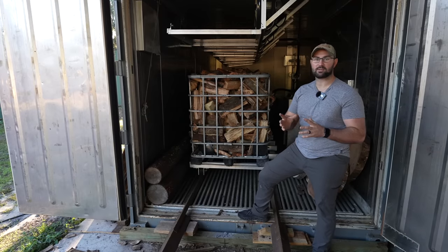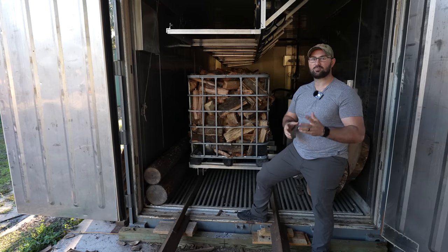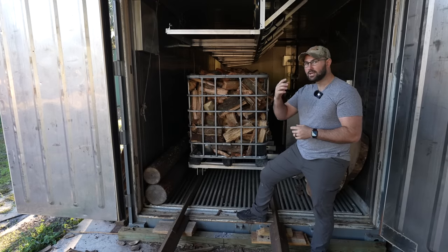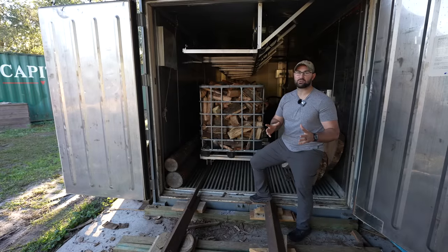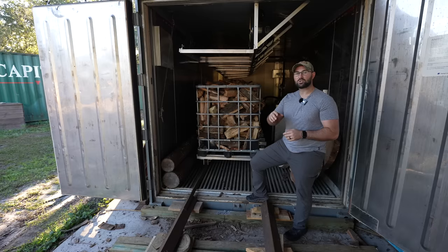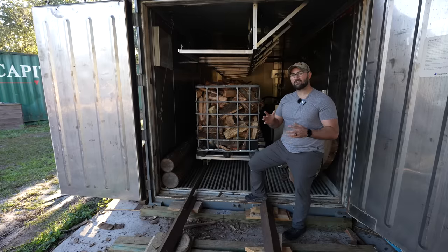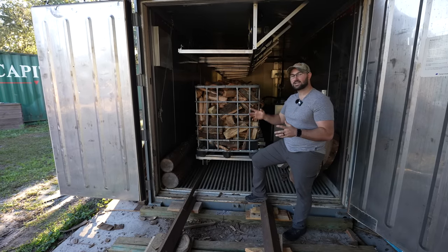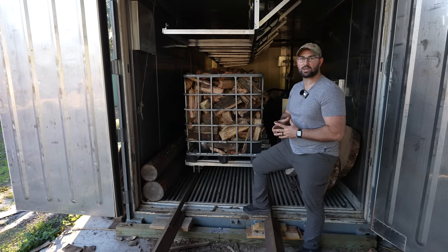After a couple days in hybrid mode, once some of that moisture has started to get out of the kiln, we switch it over to dehumidification mode. In dehumidification mode, all it does is use the compressor to take the moisture in the air inside the kiln and pump it out to a bucket on the back in the form of water. To recap in simpler terms: we load in the fresh totes of firewood, dry them on hybrid mode for about two to three days, switch over to dehumidification mode, finish the drying cycle for about another two to three days, and in that five to six days we take that fresh firewood testing 40 to 50% down to 12 to 15% where we can sell it as kiln-dried firewood.